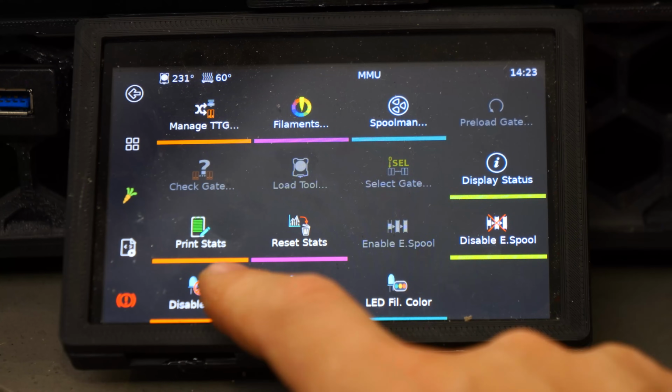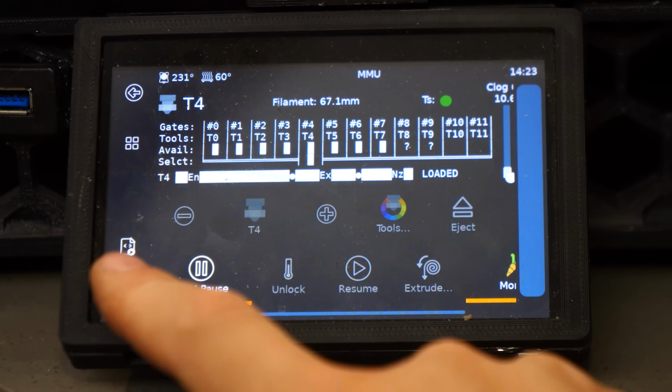The next thing I should have done was upgrade KlipperScreen to the ERCF compatible fork to test and see if it would even work. This is because if you're on an old version of Python and Raspbian like I was, there won't be any easy way to upgrade the Python libraries that KlipperScreen will use. Actually, upgrading Python won't do it. Long story short, you are going to need to flash a completely new SD card.